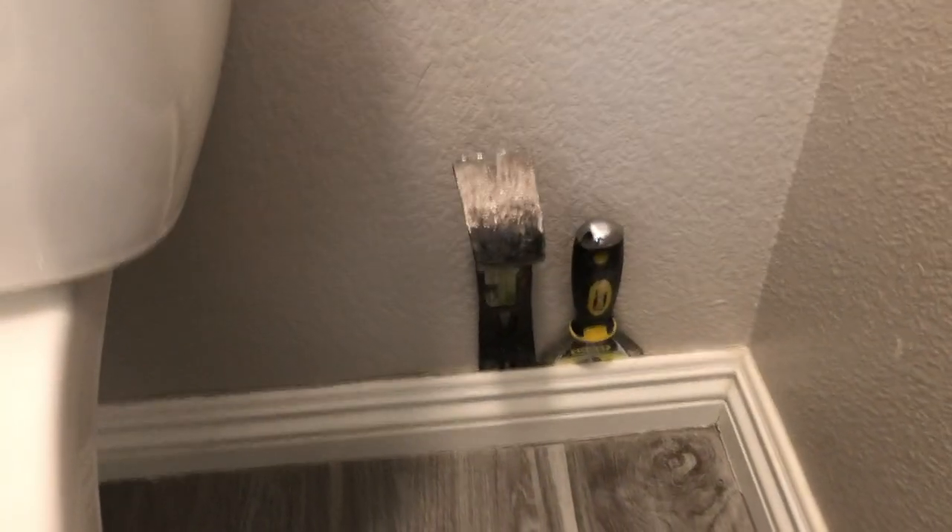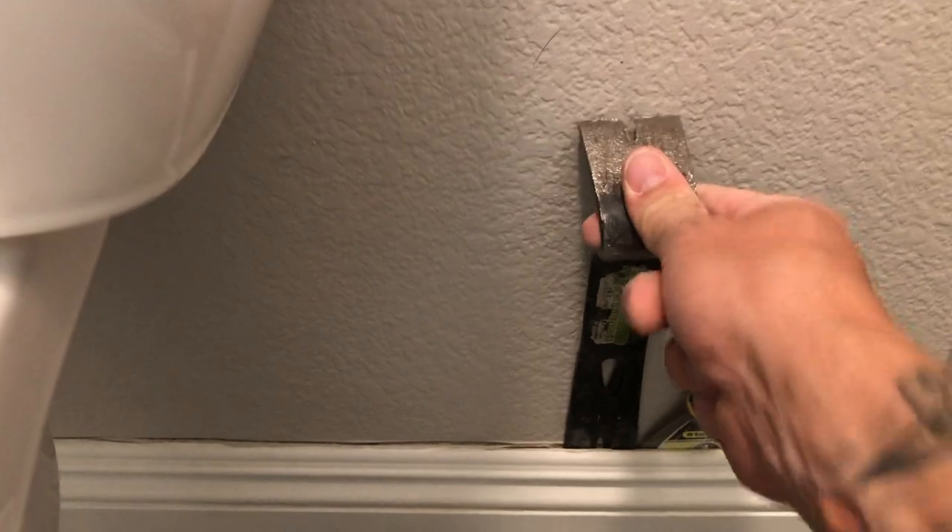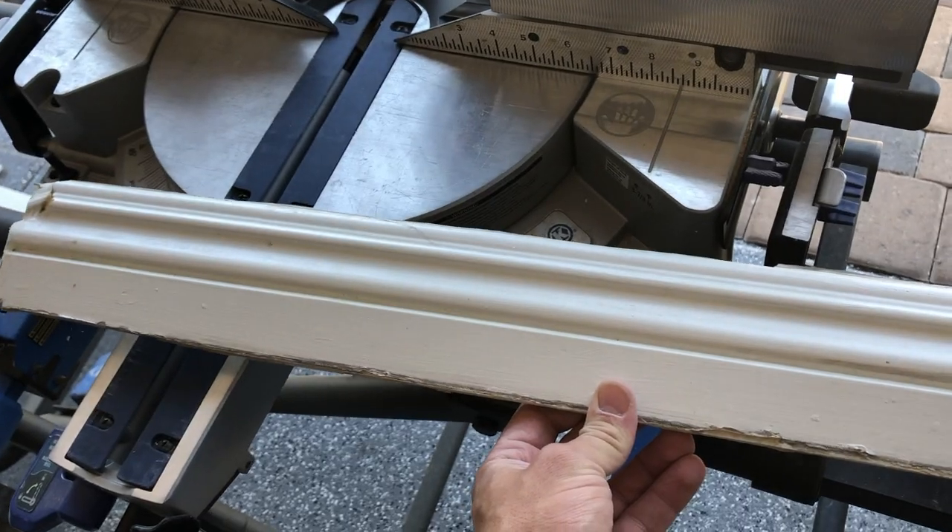That way when I finished installing, all I had to do was come back and do a little bit of touch-up. I brought that paint with me and when I was all finished I could touch it up. The bathroom was a bare wall, about 35 inches wide with 9 to 10 foot ceilings. The first thing was removing the baseboard — I used a little pry bar and a wide putty knife to help pry it off the wall without causing too much damage.